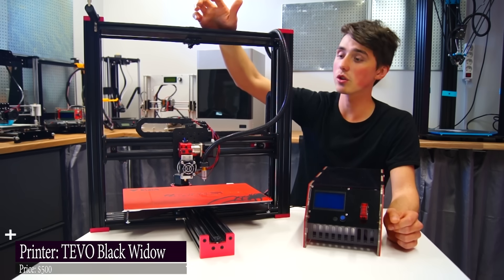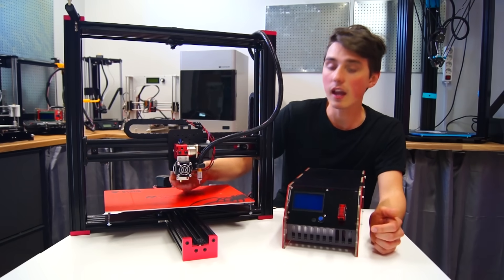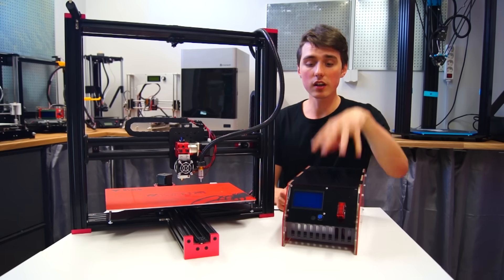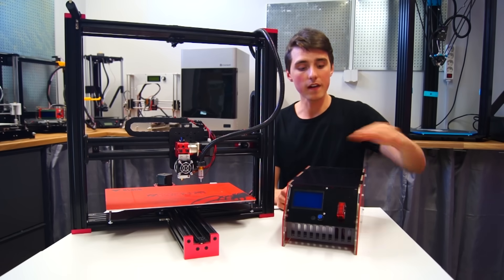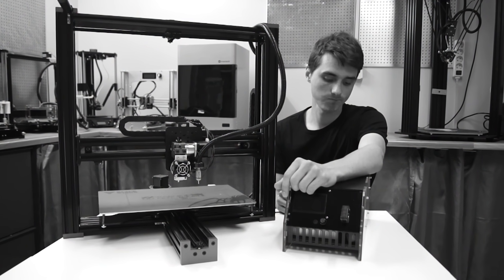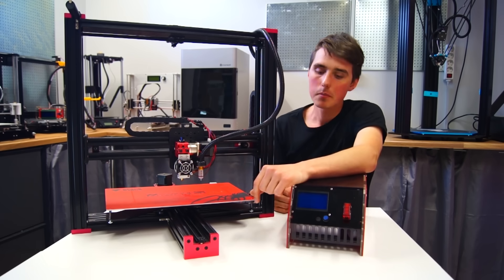I really wish I would have some good news about the Black Widow — I know a lot of you have been asking for it. But right now I don't even know if there's going to be a review of it. It all started with a faulty hotend — I replaced it, no big deal. The prints were beautiful and I was really impressed by how well it coped with flexible filaments. All of a sudden the display was showing incorrect temperatures. I replaced the thermistors — didn't help. I flashed the motherboard with new firmware — didn't help. I replaced the entire motherboard — didn't help. So I am stuck. I was looking forward to reviewing this printer and adding it to my arsenal, but I don't think that's going to happen.